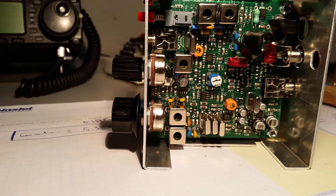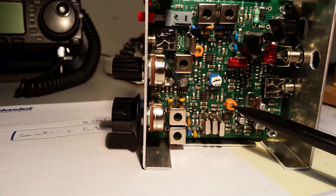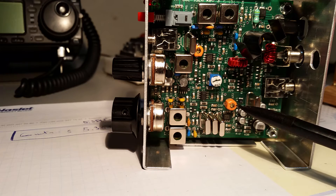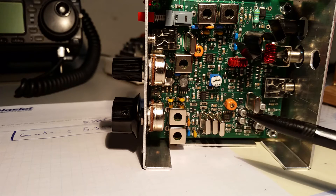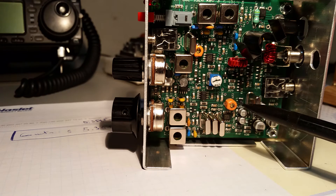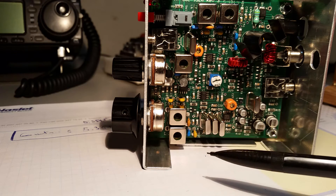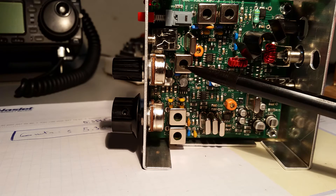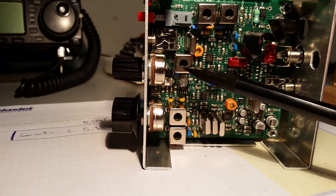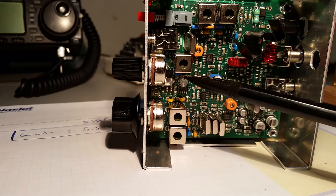The alignment is quite simple to do. The first thing you have to do is set the BFO. Depending on the band you choose — meaning which frequency band — so if you have a 9320K or 9340K, that frequency is not the same. It has to do with the crystals used. To align these you need a wideband receiver or a transceiver which can also receive broadband. The second alignment is the VFO calibration, which is here. With this you set the starting point in the frequency band.